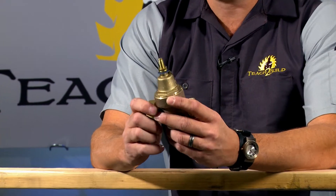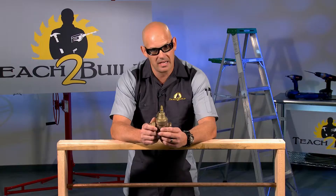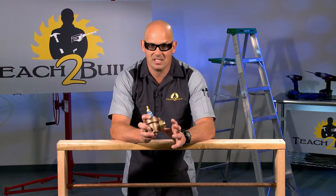They look like this, and they're most commonly found on the main incoming water supply line. They might be in your crawl space, they might be up by your water heater, and occasionally you'll find them on the main water line in the yard. But if you haven't seen one of these and you check your water pressure and it is above 70, 75 — no more than 80 — if it's above 75 or 80, you need to install one of these.